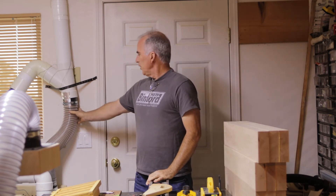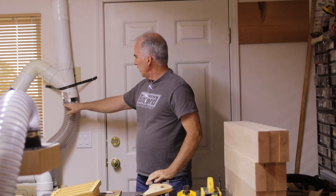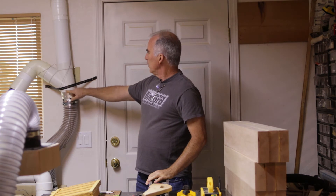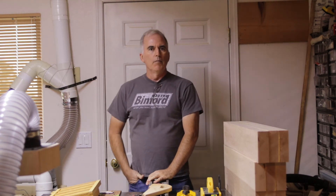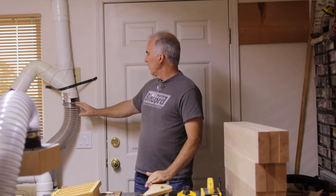Because you don't want that coming loose. Some people run a wire along the inside of the pipe, but then you're risking clogs, especially with jointer or planer shavings which can be longer shavings — you can really get clogged up easily with a wire on the inside of the pipe. So let me show you some close-ups of what I did. The flexible tubing which I use near each machine — I also have the wire from the flexible tubing connected to the clamps, which is connected to the wire and the aluminum tape. I also went ahead and connected the flexible pipes; the wire on the inside I stripped off the plastic and connected it to the clamps and to the aluminum tape also.